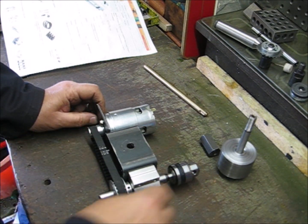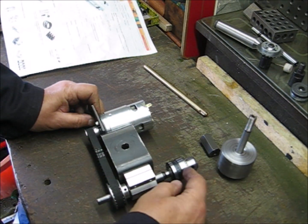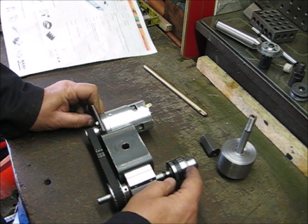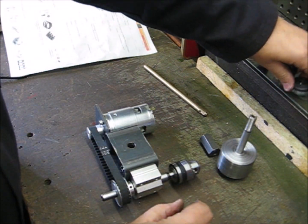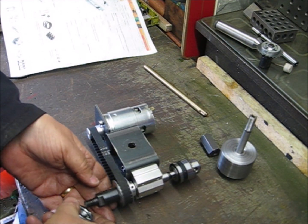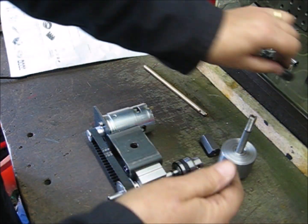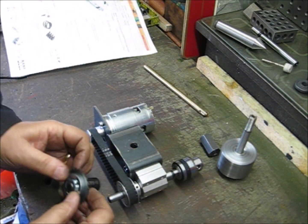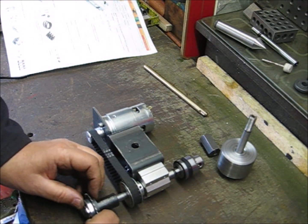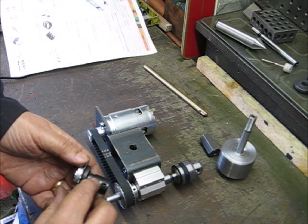These come as a kit from Banggood or eBay. You can have different sized chucks on them. This is a maximum capacity 6mm chuck and it comes with an adapter that goes on this end here, which you can use for mounting saws like this one here — that's a little slicing saw. They're held onto the spindle at that end with some 5mm grub screws, and that's just held on with the Jacobs taper.